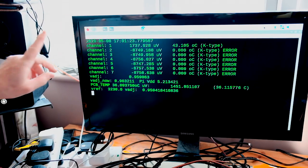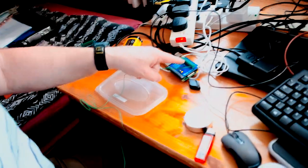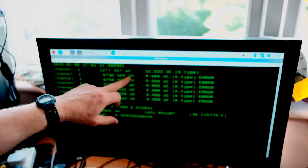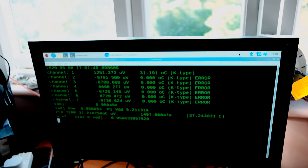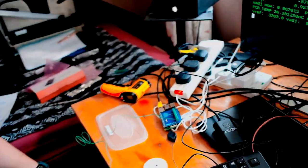The TH7 has detection circuitry to tell you if a thermocouple is not connected. So if the thermocouple became cut or broke open and went open circuit, you would see this because this circuit board detects if there's nothing connected and gives you an error signal on the channel. Some thermocouple readers will simply give you the temperature of the PCB back if the thermocouple goes open, but not this one.